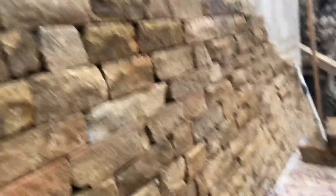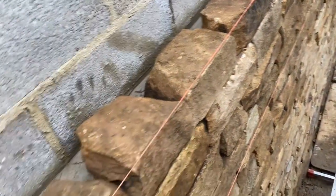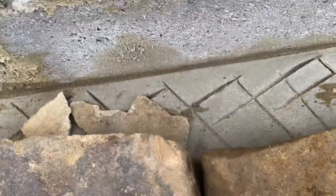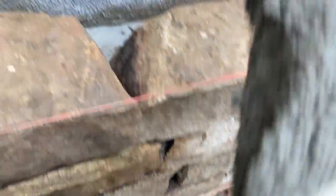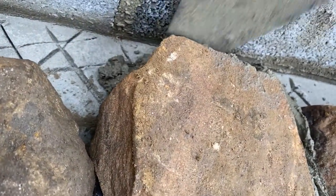That little course is on there now. You can see the little pins under our stones — this is all in line. Obviously if this were just dry it would be weak, but you can see those little crosshatches that have been put in so we can get a bond to our mortar. So we're going to get the cement in here now, make sure every little piece has got some mortar in it. Paul is here and I'm putting the mortar in one-handed — chopping it in between the joints, making sure it's all pushed in as much as possible, almost filling all the gaps up at the back like a little bed.